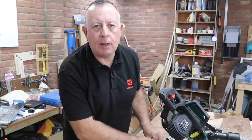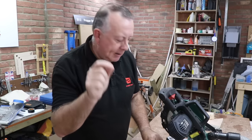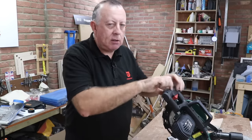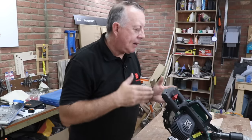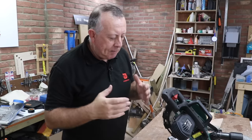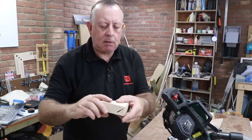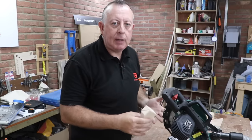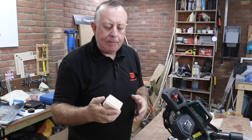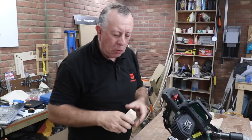First, the mitre cut: when you put it on a preset like 45 degrees it obviously wasn't exactly 45 degrees, which is okay, but to then adjust it by a little bit is really difficult when you haven't got a handle sticking out the front — you're just trying to twist it around, so that doesn't really work very well. Secondly, because the blade is so small and it's got no slide function, the amount of cut when you set it at 45 degrees in either direction is quite limited. I tried to cut through a 3x2 at 45 degrees and I didn't get all the way through — the blade is just small and there's no slide. So for mitre cuts and bevel cuts, I wouldn't rely on this machine unless you're cutting really small bits of timber.